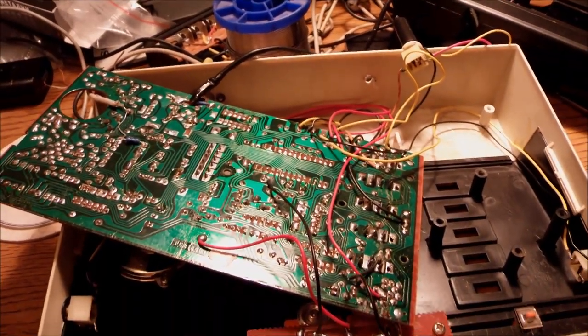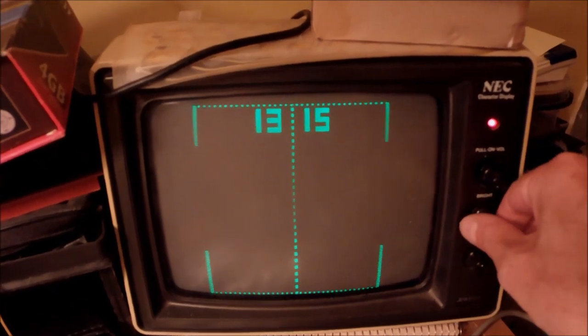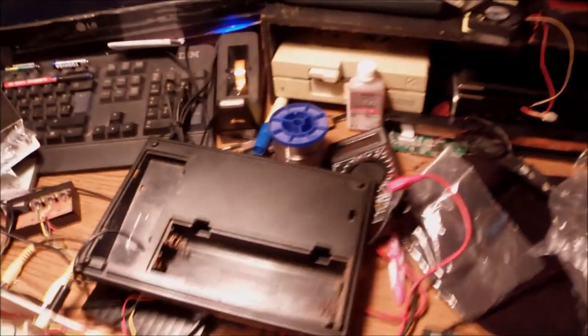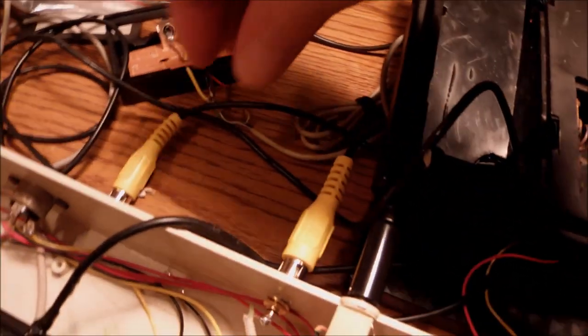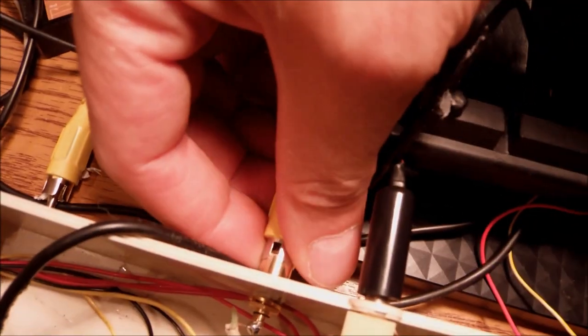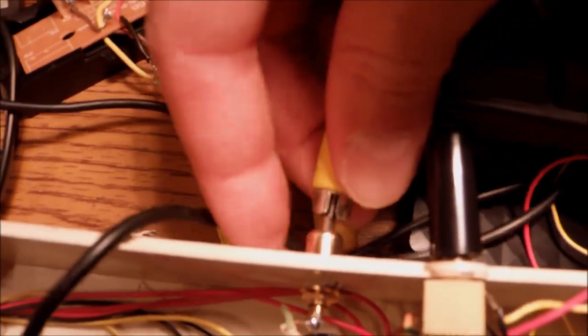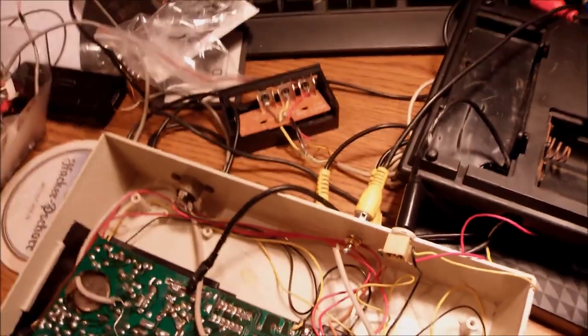I have prepared my hole here. Apart from the drilling, I'm switching the RCA to the other output — the monochrome character display — to verify. The drilling is done. I have placed the female RCA jack at the back of the machine and we're getting great results. Switching back to the TV — the AV3 input in this case — everything looks normal.